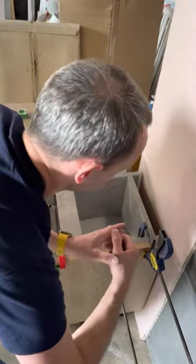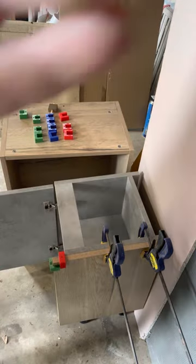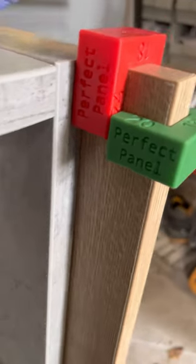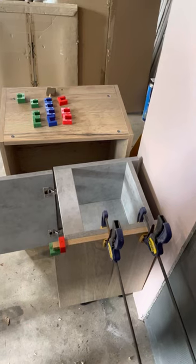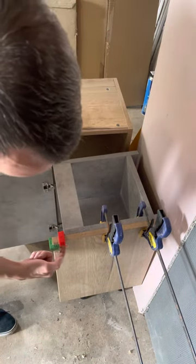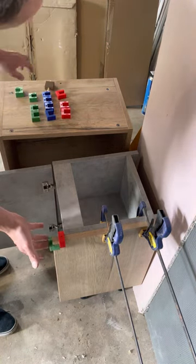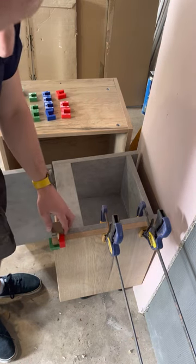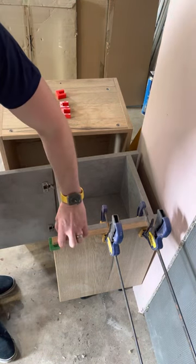Get that to where you want it. Now on the front edge here — that's how it wants to be. The width we need to get rid of, as in the scribing distance, is the width of this jig here — that'll give you the perfect overhang as determined by this jig. The bronze scribing jig: the edge of that to the centre of the pencil is exactly the same width as all of these jigs, so you can use any of these jigs as the spacer — it doesn't have to be that one.